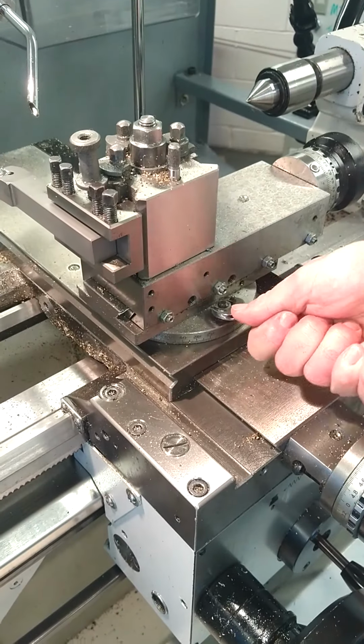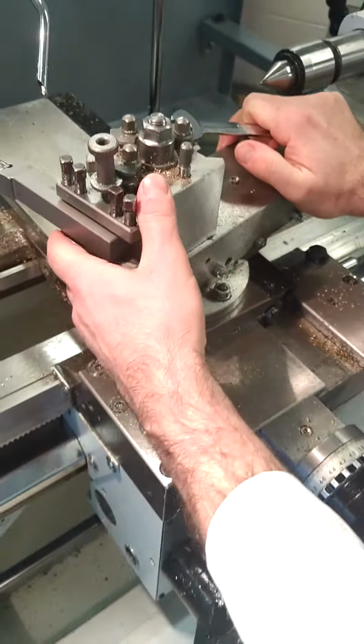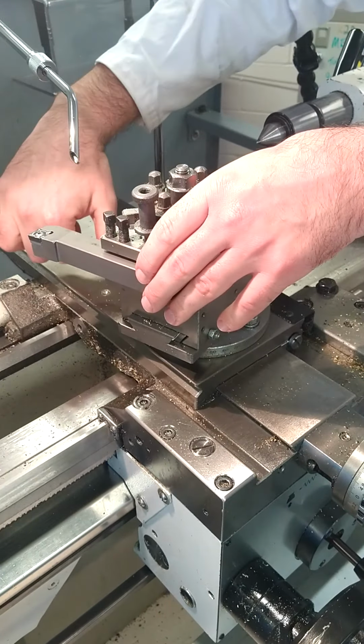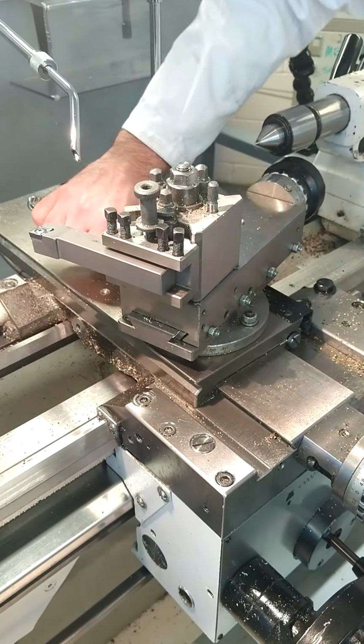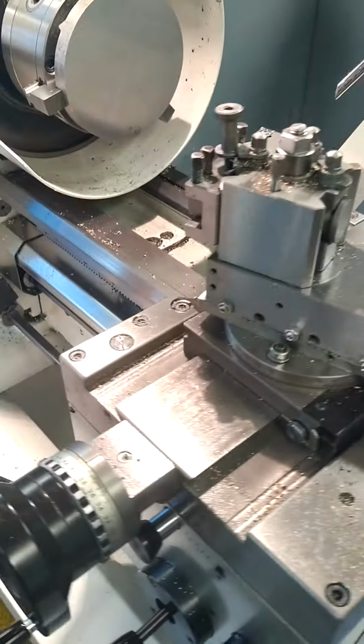So we open this nut here and the one at the back. Then we offset the one 15 degrees, and that allows the correct clearance angle for the material to escape as we wish, as we are facing off the part. I'm going to leave off the coolant as I'm doing the video, but you can apply coolant onto the cutting tip to cool the process.